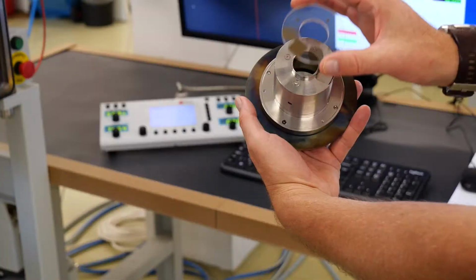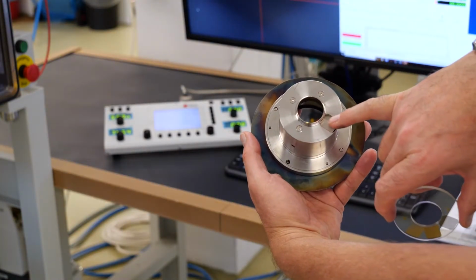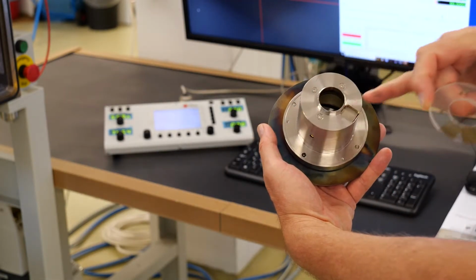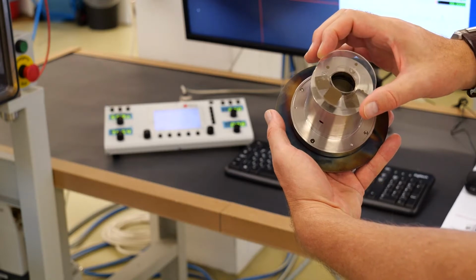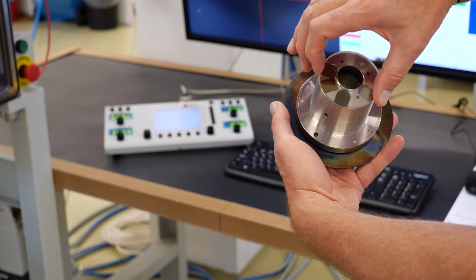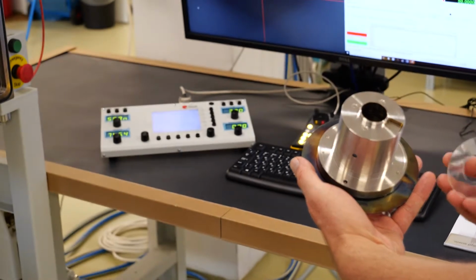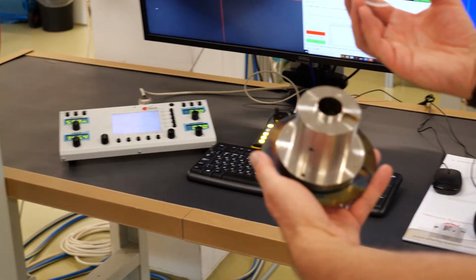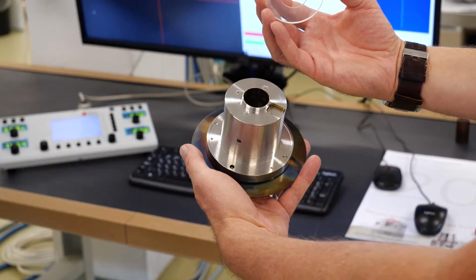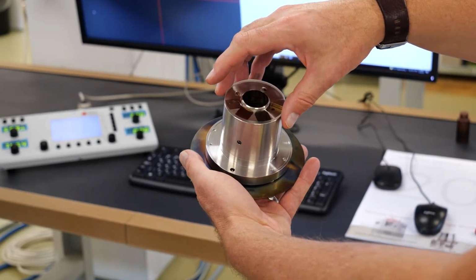So what we see here, this is the glass disc, right? This one. And here we have the shutter, right? This is the shutter blade opening. It's externally operated by a pin, right? So this will make the shutter open and close. When the window is coated after some time, you just take this one and rotate it further to the next position. Depending on how heavy this is coated, you could try to wipe it off. The important thing is it's electrically coated, in order to make this non-charge up. Otherwise the beam would interfere.